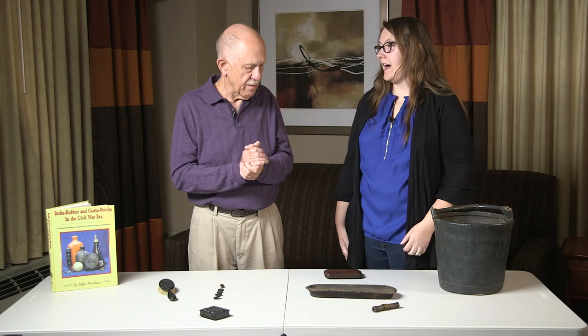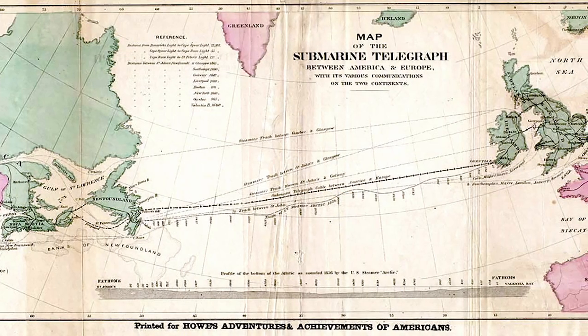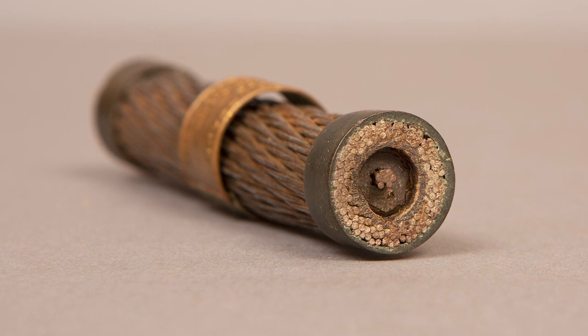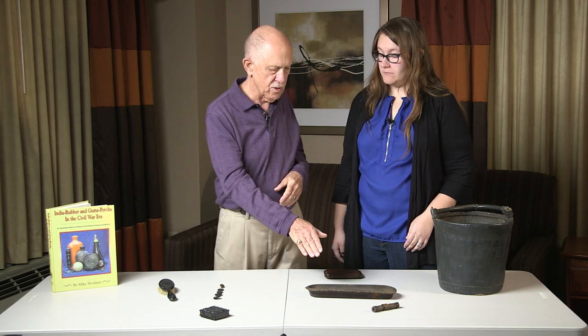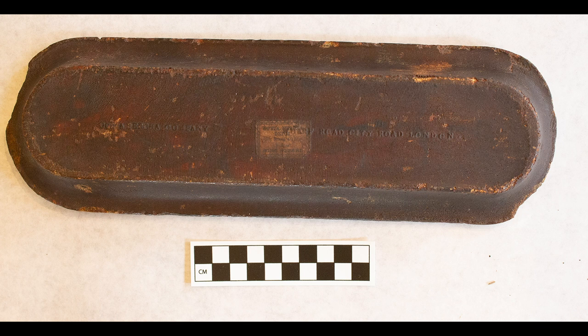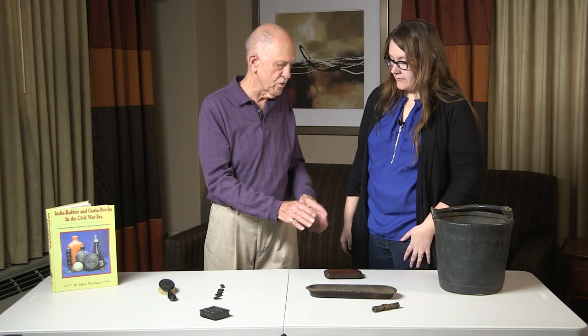We also have an example of insulation — that's a piece of the surplus transatlantic cable that Cyrus Fields laid in 1858, a single conductor insulated on the inside with real gutta-percha, which by the way is still used in root canal therapy today. When we talk about real gutta-percha, this pen trough from England, made in London in the 1850s, is an example of processed early molded gutta-percha — not vulcanized or ebonized. You can see the huge difference between real gutta-percha and hard rubber: hard rubber is so much more finely detailed, smooth, and shiny. That is not.